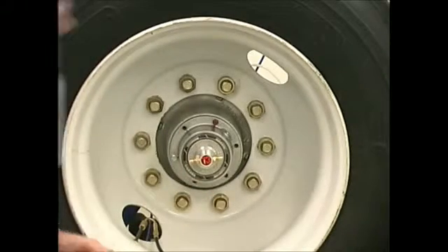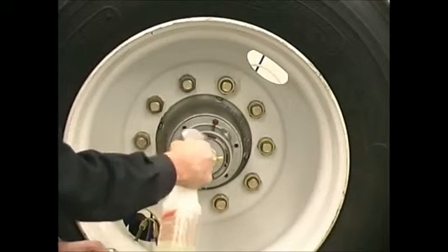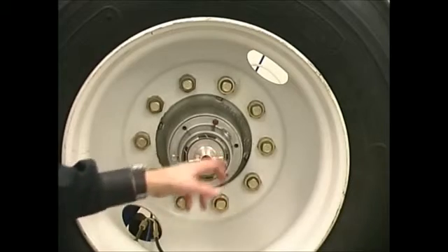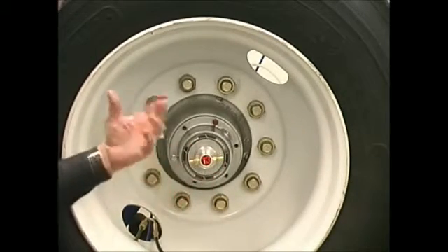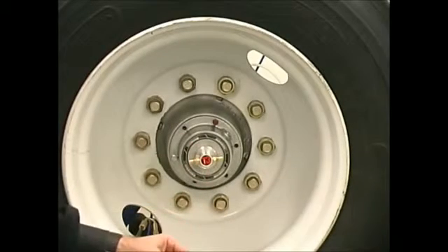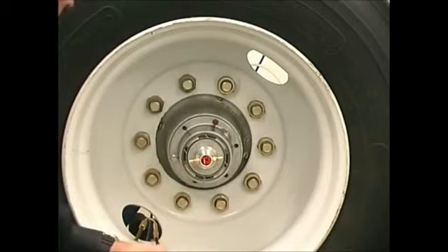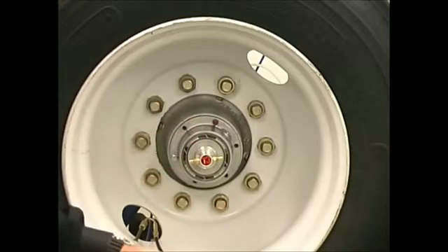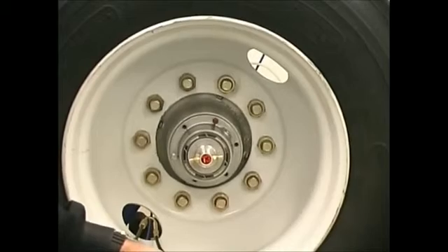Okay, so the system is pressured back up. I get my soapy water and spray the rotary union. As you can see, there are no leaks — no air bubbles coming out of the poppets. I've solved my problem by replacing the stator. It was leaking either at the seal or at the thread. So now my system is secure and sealed, and that's the fastest and easiest way to troubleshoot your T3 automatic tire inflation system. Thank you.